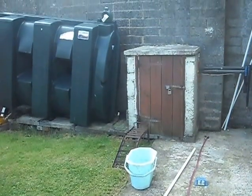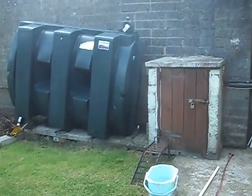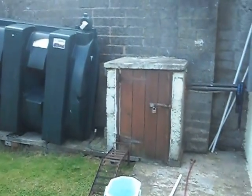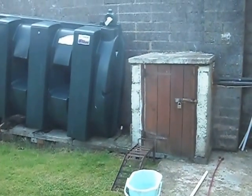What we have is a 12-year-old plastic tank. We got a delivery of oil in the winter and left it to settle for a couple of hours to allow all the water and junk to resettle. When we turned the heating on, the burner broke. The water had got through from the tank to the fuel pump — it actually rusts and breaks the fuel pump.